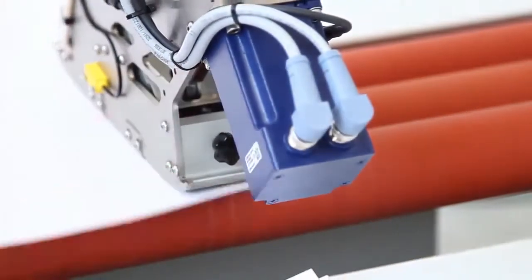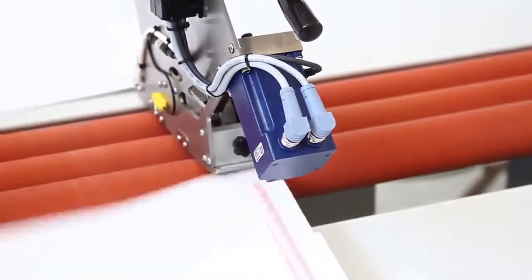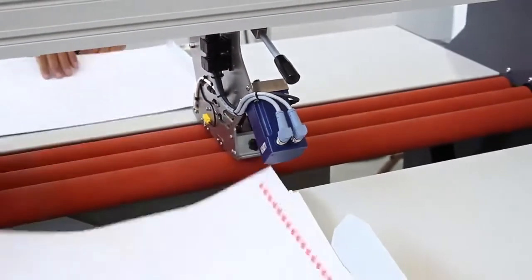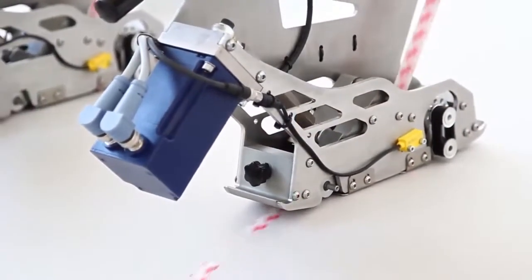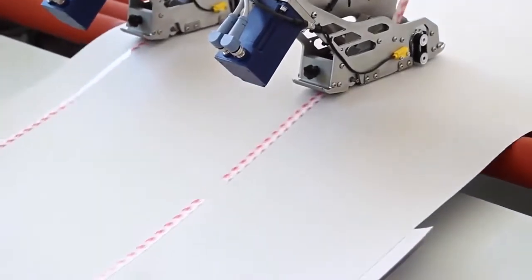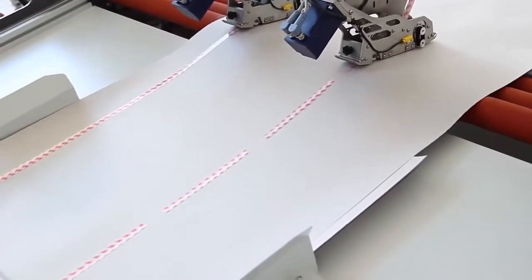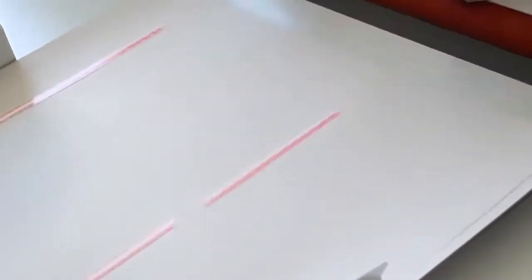Our patented application system eliminates all of the technical gaps associated with the old pneumatic systems, which were the cause of most major application and maintenance problems. The double photocell easily reads color and transparent materials and permits the application of tape anywhere necessary. The minimum applicable tape spot length is 25 millimeters. Spots can be at regular and irregular intervals to save tape and simplify handling.